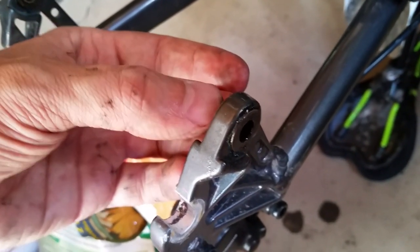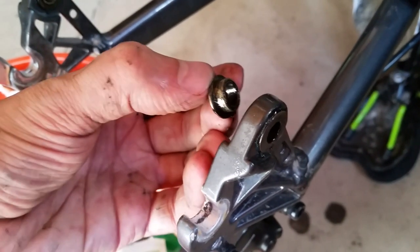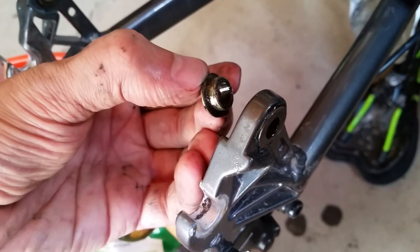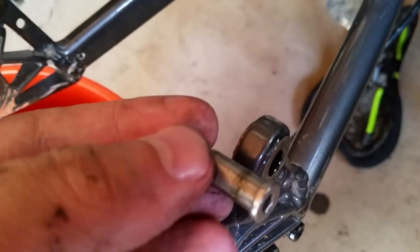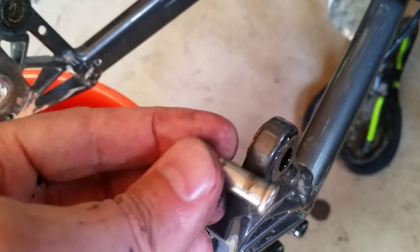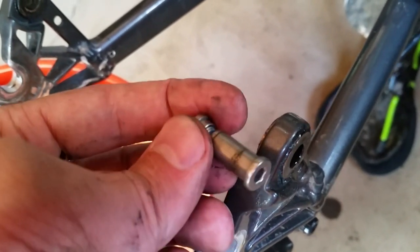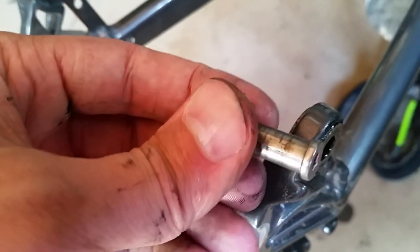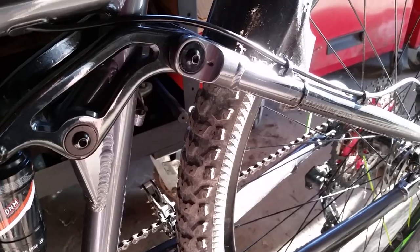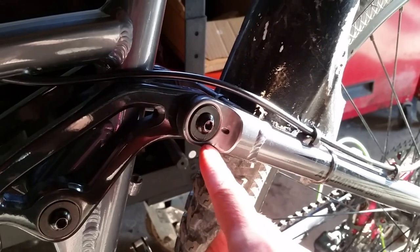Also, if anyone was curious about the rear pivot points, they are brass babbitt — two-piece. You can see one still in the hole while I have the other in my hand, and just a metal pin goes through there and it rides on that. I just make sure it's greased up real well. The first time I took this apart it was bone dry, and you can actually see the scoring right here from it not being properly lubed.